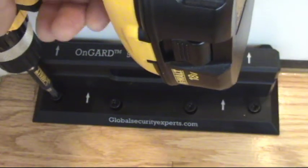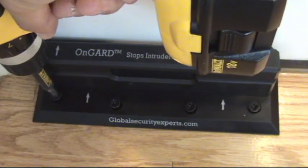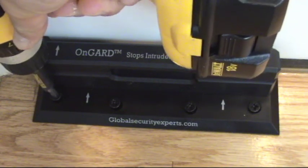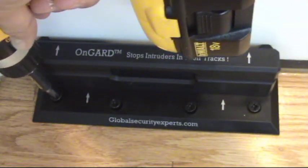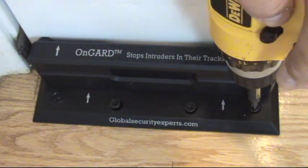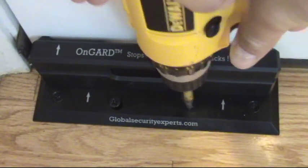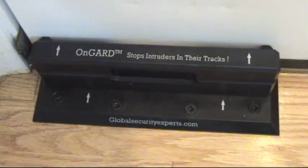Now I'm going to go in with all of them. I'm going to set my drill so that it breaks at some point so it doesn't strip the screw. That was too low — try 17. 17 did it. Going on this end, there you go, there you go, one more — and I'm done.